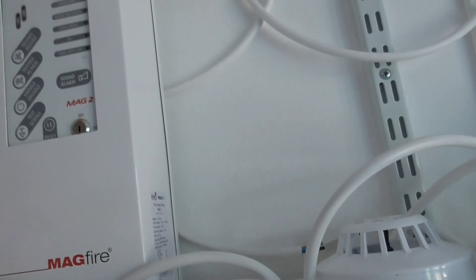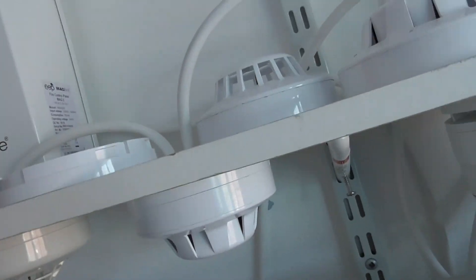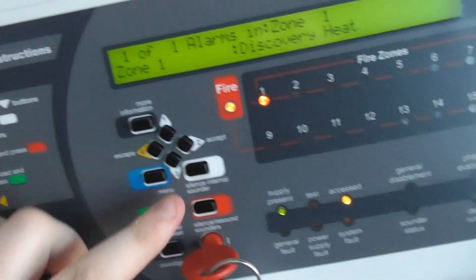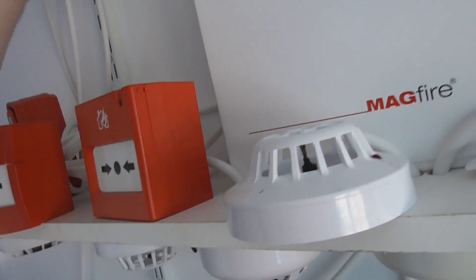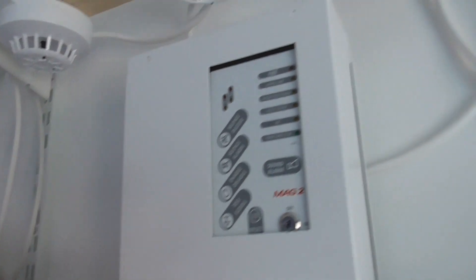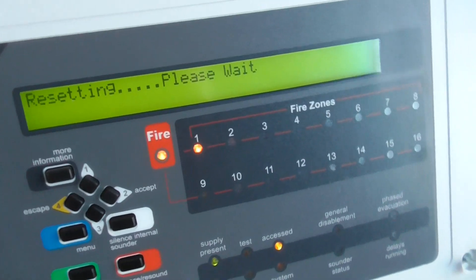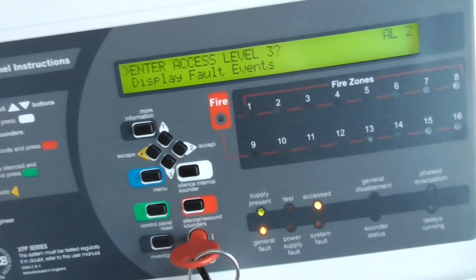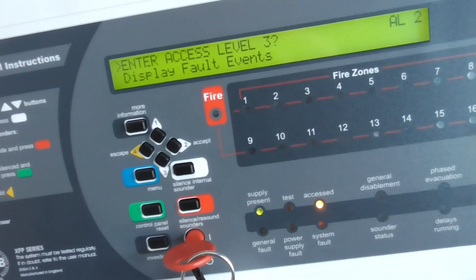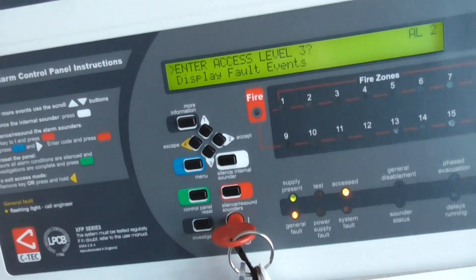Let's take that off the base because it's a little bit warm. It's going to come up with a fault. I think the XP95 heat detector has cooled down, so we'll put that back on the base. I'll let the Discovery detector cool down for a bit longer, but I'm going to end the test here. I'm going to press reset and finish the system test. That's it for this system test — I hope you guys enjoyed, and I'll see you next time for the next system test. Bye guys.